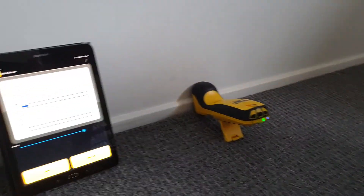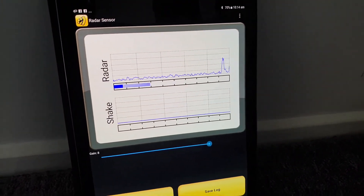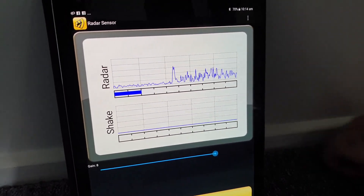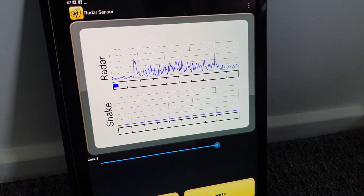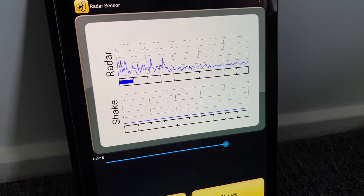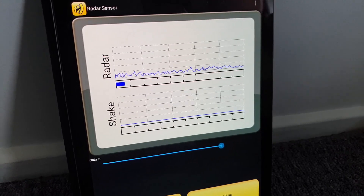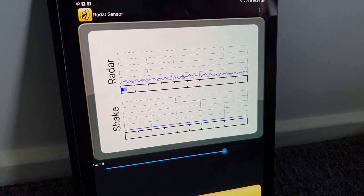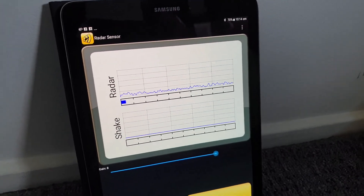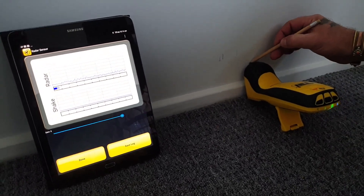It is showing a little bit of a pattern. You'll hear this — I'll give it a tap. You'll see that's intensified from me tapping. Now we'll sit back and watch what happens to our pattern. What's happened — you'll see from where I hit it, it's disappeared. The pattern has changed a little bit from when we initially put it there. That's a good indicator the termites are there. I'm going to pencil this position.